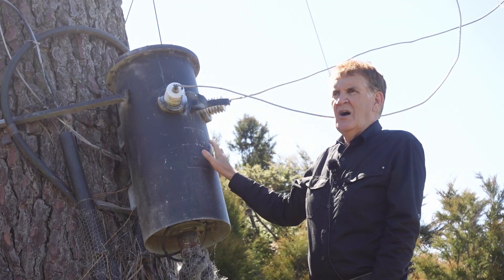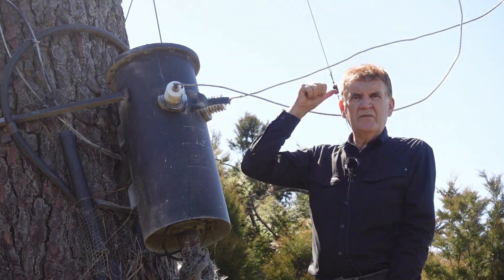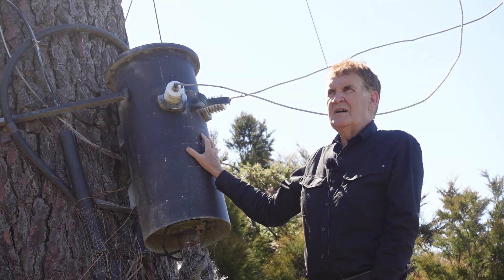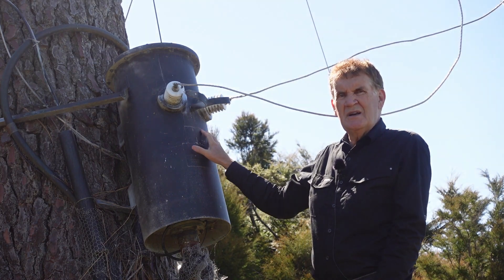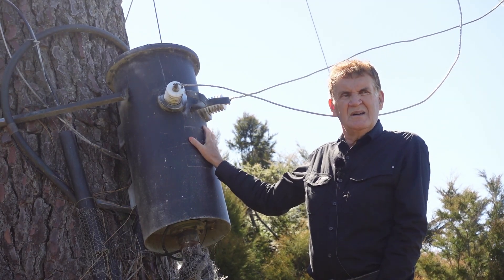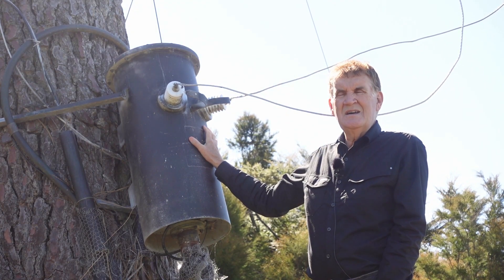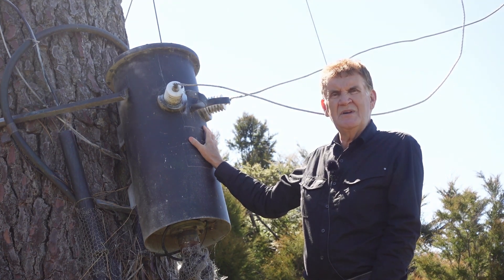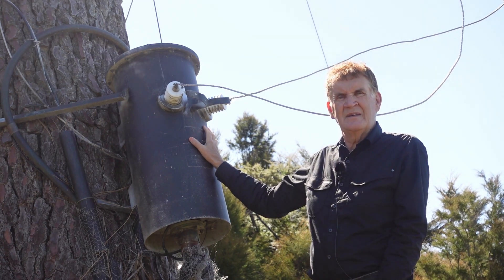I didn't make this balun — it's a commercial unit. Running it with a tracking generator and spectrum analyzer shows it works from the broadcast band up to 30 MHz, reasonably flat. I have tried it on six meters and I can trigger repeaters over in Wellington — about 160 to 180 kilometers from here — without much problem. But generally I prefer dedicated antennas for VHF. For two meters and 70 centimeters I've got a vertical collinear array, which gives me 12 dB gain on 432 MHz and about 9 dB on two meters, omni-directional.